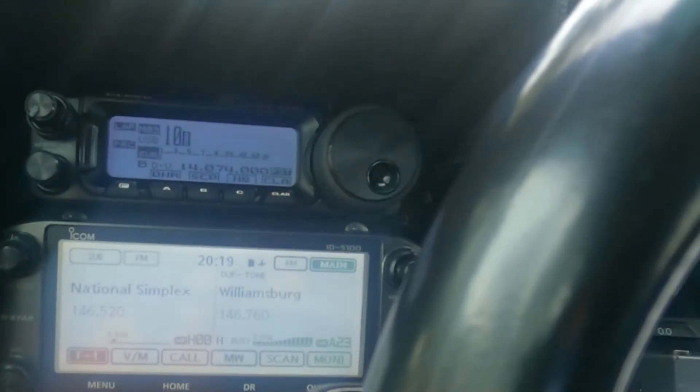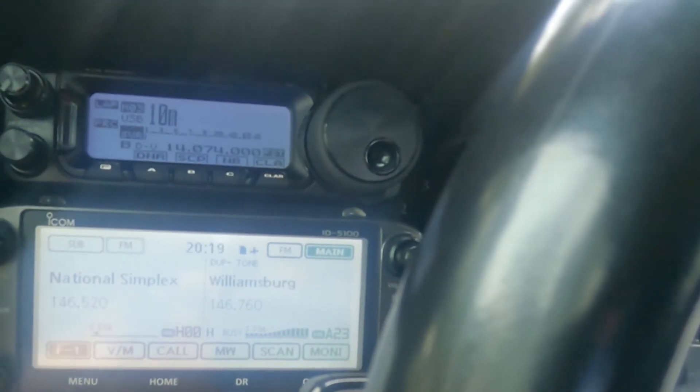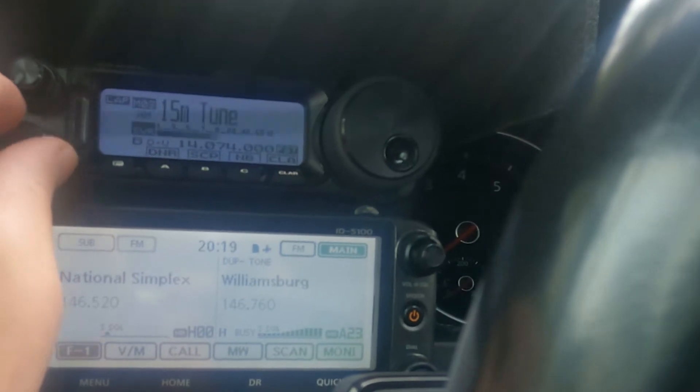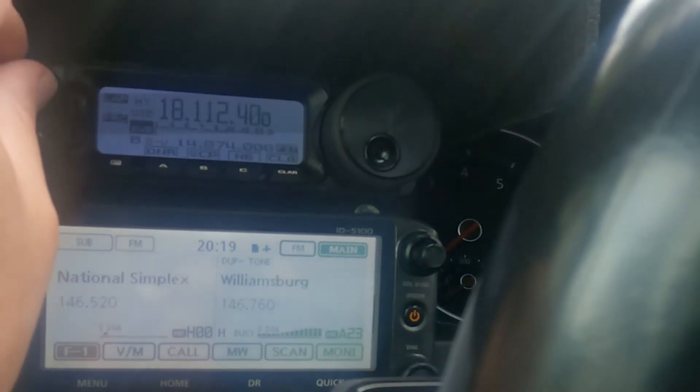The TuneMatic — the more you use it, the more you store, the more you tune, the more it will remember. There will come a point where all it will do when you press Tune is key to measure frequency and power and then just tune to the frequency. If you've already watched my Scorpion video, you know that with the capacitance hat mounted, I can't tune 10, 12, or 15 meters. So I'll go to 17 meters and turn this up to see what's playing.